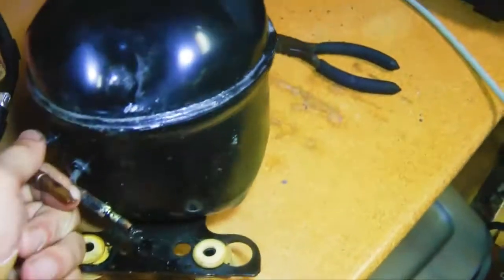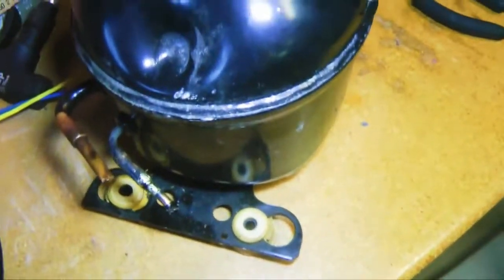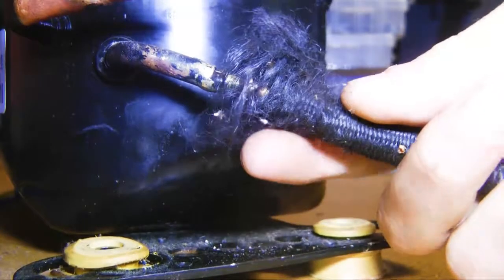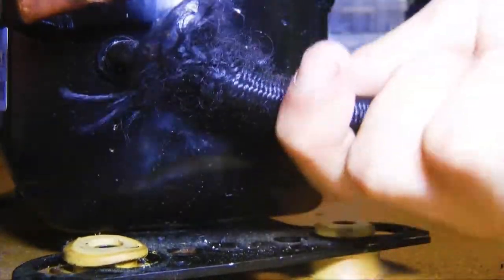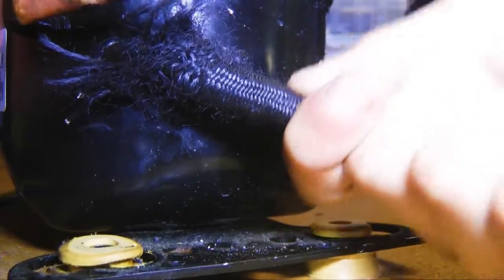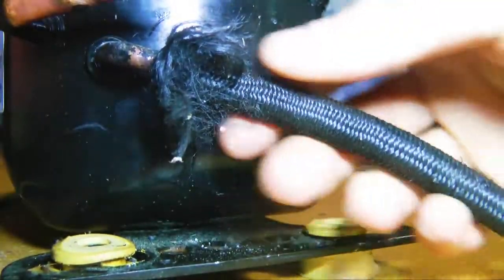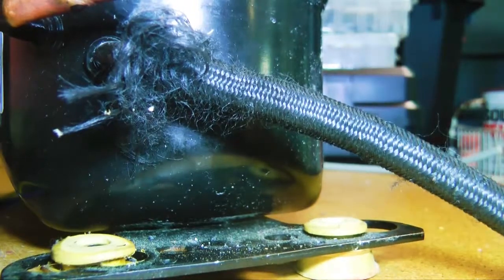The problem is it's really heavy, around 20 pounds, and there's nothing we can do about that. So let's do it. For this, I would highly recommend putting a hose clamp on it, because when you have a tube connected to another tube and just pushing it on, they always tend to pop off when you least want them to. A hose clamp will prevent that from happening.